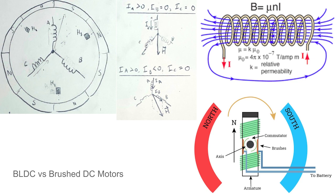So what is a BLDC or brushless DC motor, and why is a motor controller needed? All motors operate on the principle of converting electrical energy into mechanical energy. Just as a note, this is the opposite electromechanical conversion that an alternator makes, but both rely on the same principles of current, magnetic fields, and electromagnetic induction. BLDC motors eliminate the need for a mechanical commutator found in brushed DC motors by reversing the motor setup, where the windings are found in the stator and the permanent magnets are attached to the rotors.